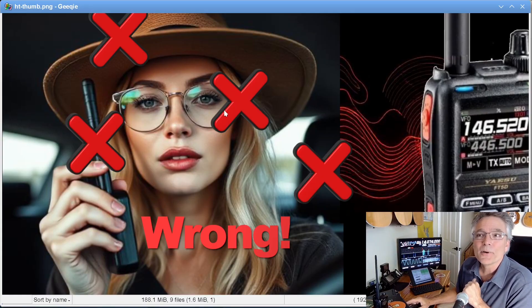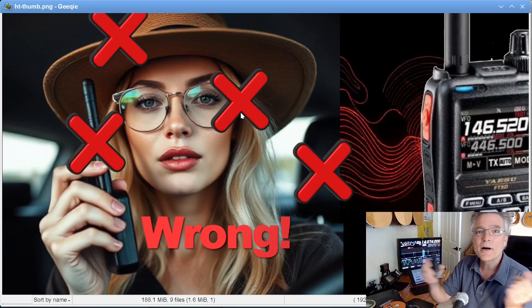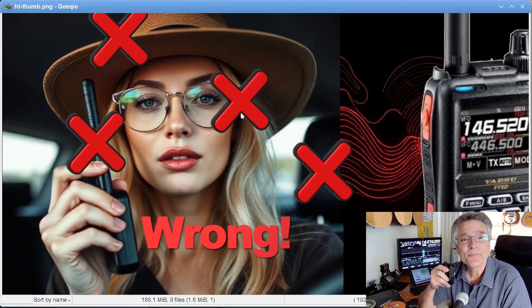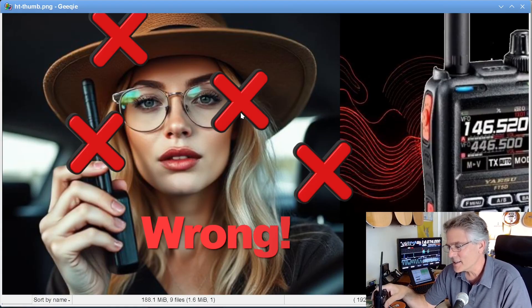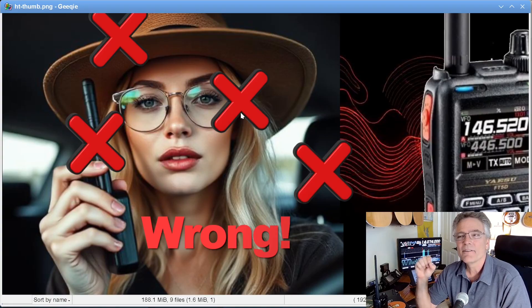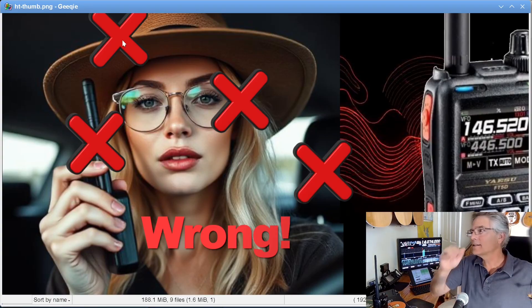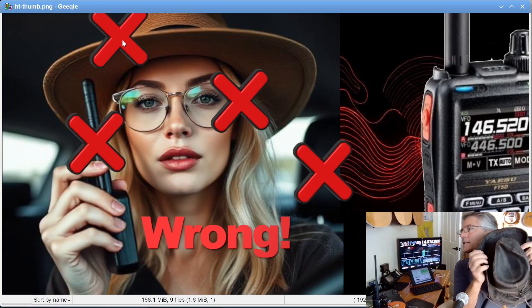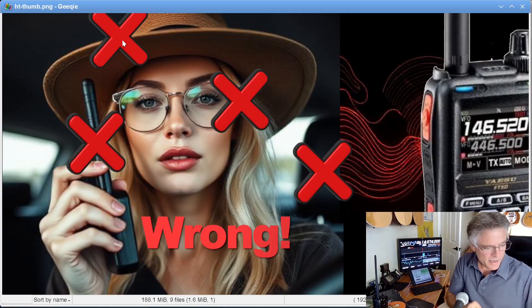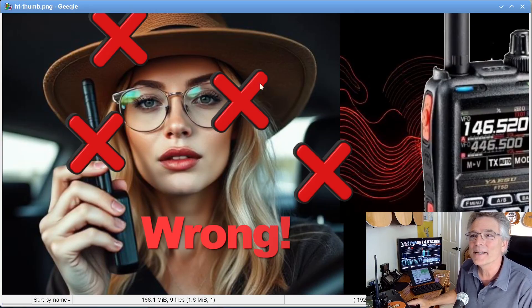Secondly, a lot of people aren't aware of this: this person's wearing glasses — let's assume they are wired glasses. What did I say about metal being next to an antenna? Wired glasses next to your antenna are going to squish your donut. Also, I put an X next to the person's hat — this one has a piece of metal that maintains the shape of the brim. Again, metal next to the antenna is going to squish your donut. You're going to have a bad time.